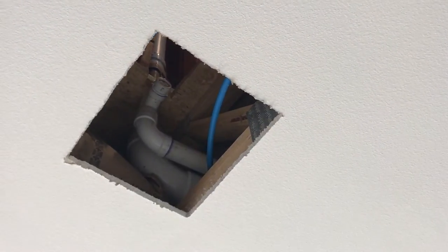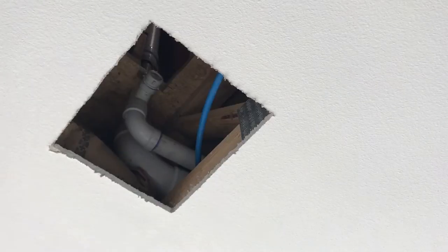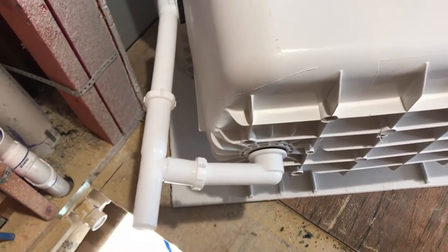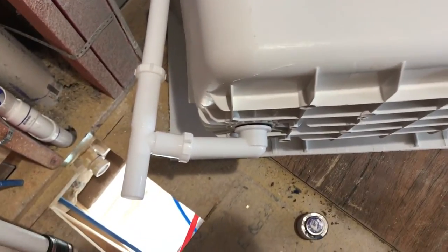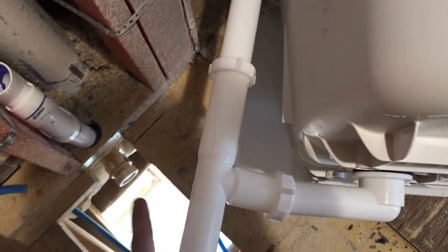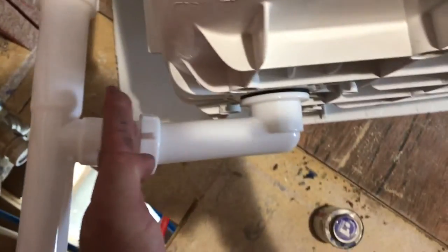Now I'm going to go back upstairs, slide the tub, get the tub drain installed, and slide the tub into place to see how everything lines up down here. I put together this drain kit, and looking at it, the thing is not square at all. This is a 90-degree tee, but the factory has this molded bend to try to offset the tub slope — but this is more than my tub slope, so it's sticking out at an angle. I tried to dry fit the tub in place and it won't fit, so I'm going to have to get some sort of flex coupling adapter to go here to turn it straight, so I've got a good connection. It's really short — I just did it to rough in the dry fit — so the flex coupler will give me the extension I need, and I'll have my 90 degree.